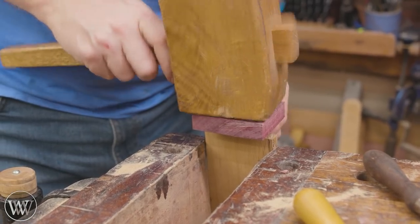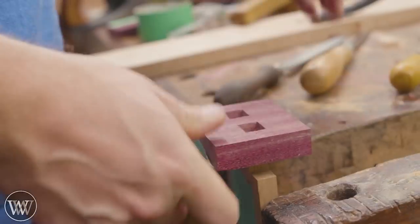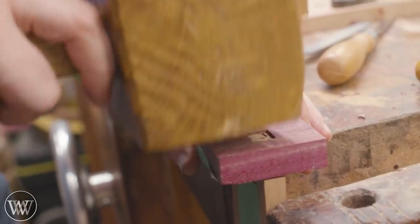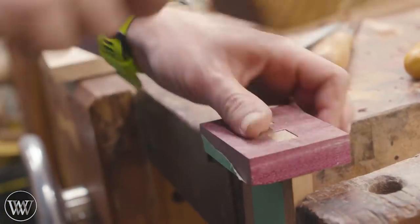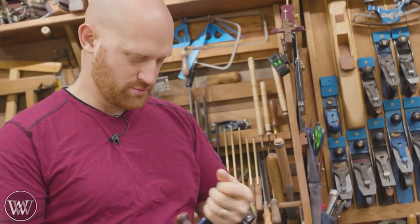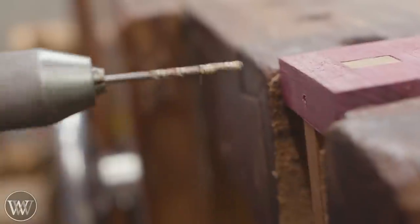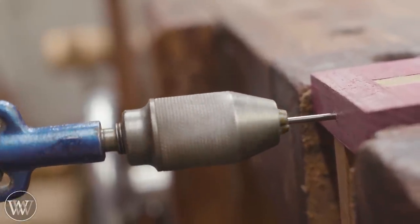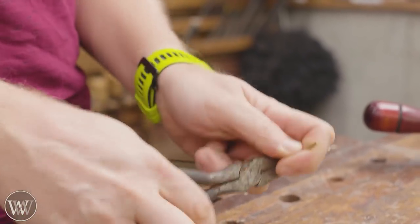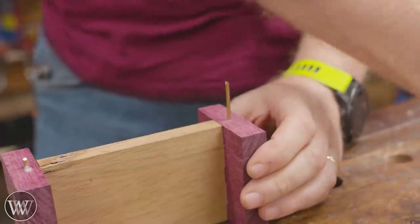Just a little bit of taps and it starts to slide down. I want this nice and tight because it is going to be on the counter, but I don't want it completely tight — I don't want it to split out the wood. In the end I'm actually going to come in and put a brass pin in this so that it doesn't slide out. So theoretically it would be dishwasher safe, but you don't really want to soak wood products — you want them to be hand washed. And there, that is one end on. So we got the other end on, and now we can drill out for a brass pin. I got this 1/16-inch brass rod. Once it's all together, I'm just going to drill in from one side — I'm not going to have the brass pin go all the way through, just in from one side. This is actually really, really tight. So the pin fitting into this is incredibly tight — I have to pound it in place. We're just going to come in from one side and pound it down in. No glue, nothing like that needed. So this whole project is no glue.